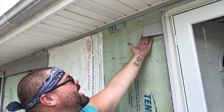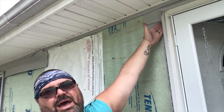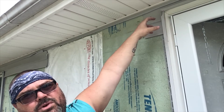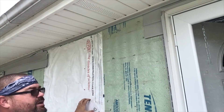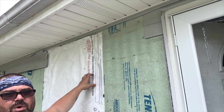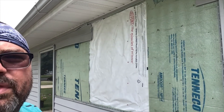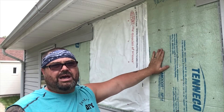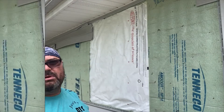Right here at the window, we're actually going to overlay this so the seam is not going to be visible. We're trying to hide it so it's back inside here, so we didn't have to take off everything on the top of the corner and create a seam right above the corner of the door. Right underneath here is the plywood that was for the old window. We've already gone ahead and got the Tyvek put back on. Now we're going to put some insulation over the top and then start weaving back in all of our siding and piece everything back together.